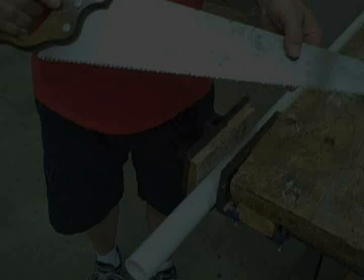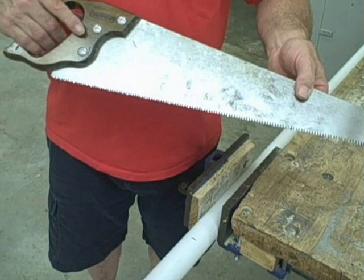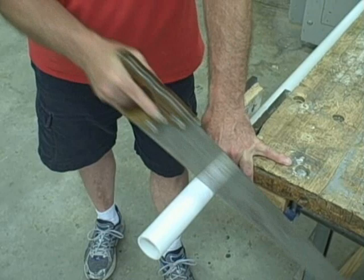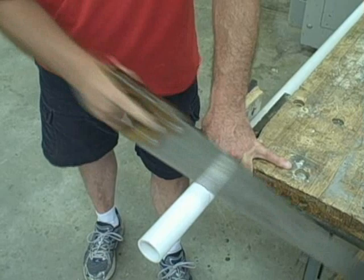This method of cutting will be with a hand saw — it's a traditional way of cutting before power tools. You want to line your saw up on top of your mark, taking nice long straight strokes, not trying to cut too much or too little at one time. You do have to work on keeping it straight; there are a couple of ways to do that, but usually you can just do it by eye.